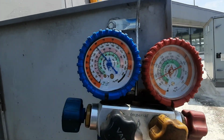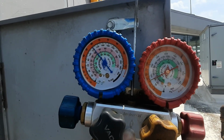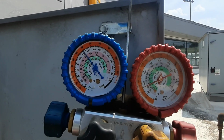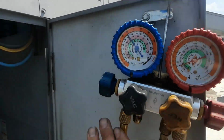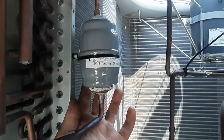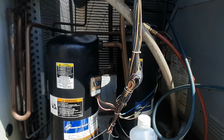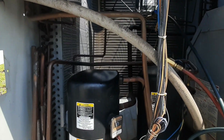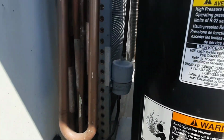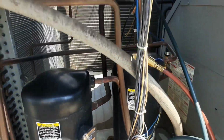So I bumped it up to just over 120. That's usually what I like to do, is just a little bit over whatever number you choose, and let it sit. It's been sitting for at least 20 minutes and it hasn't moved an inch, so I'm happy with that. Our pressure test is good. I'm gonna get my, I was gonna say hot block, but it's not hot block, it's wet rag, because I can't get hot block, but I do like the wet rag.